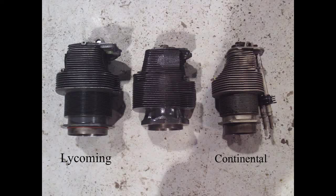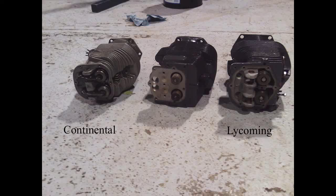One of the biggest differences between Franklin engines and Continentals or Lycomings is that the Franklin cylinder is cast all one piece of aluminum, and then they put a steel sleeve inside. On Lycoming and Continental, the head is aluminum and the steel barrel is a separate piece actually screwed into the head. Franklin was so far ahead of everybody else it wasn't funny. The top of the Franklin cylinder is machined smooth, our rocker arms are bolted on and set up nice, and we can adjust our valves — the others can't do that.